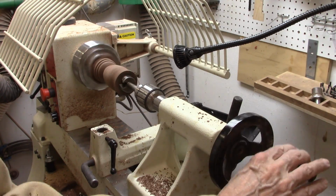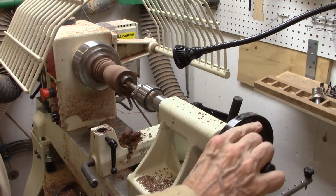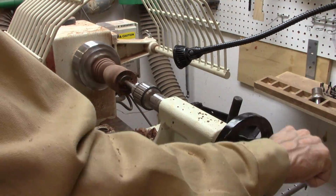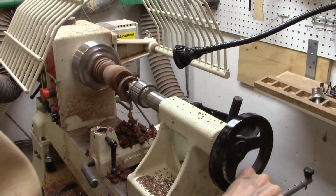To shape the interior surface of the bowl, use a 1/4 drill bit, which will leave about a 1/4 inch of wall thickness to drill into the block. Use a lathe speed of between 600 and 800 RPM. Always drill slowly to avoid undue stress on the glue joint.